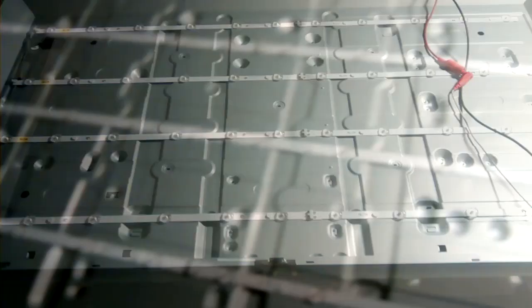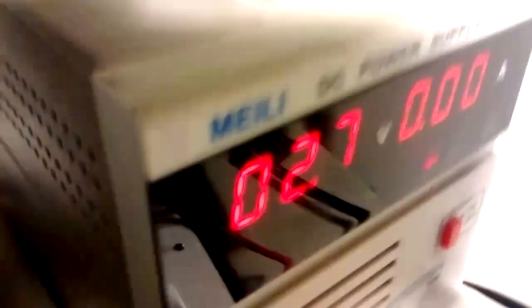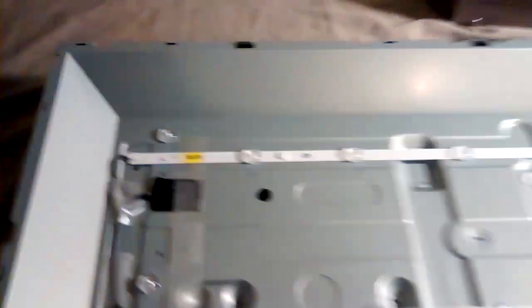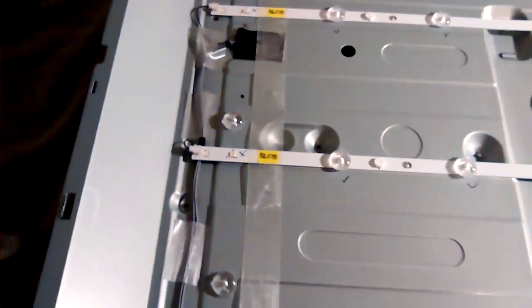Then we can lift off the white reflector sheet. There are eleven LEDs by four — that's 44. I will test them all with about 2.7 volts. By doing that we discover that there are several LEDs shorted. And on the strip where there was no current, there is one LED that was open. So these can either fail open or short-circuited.